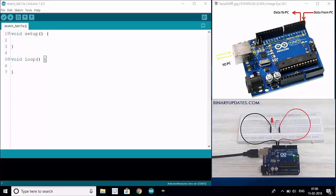You can see TX and RX LEDs here - follow my mouse cursor, they are very small. The second function is for debugging, which is very important. For example, if you connect a sensor to an Arduino board and you want to see the temperature reading, the microcontroller can read data from the sensor, but without a debugging functionality you cannot see what exactly is coming in.